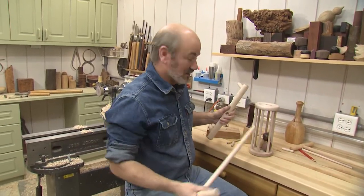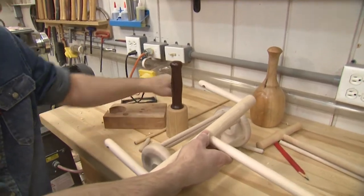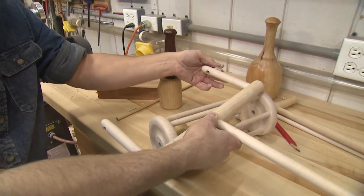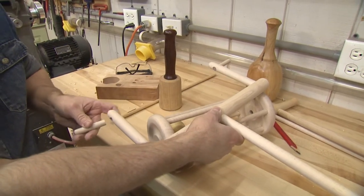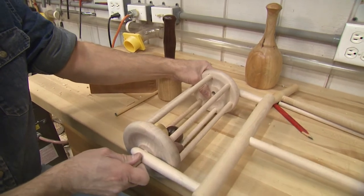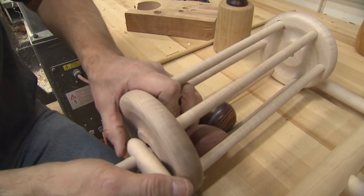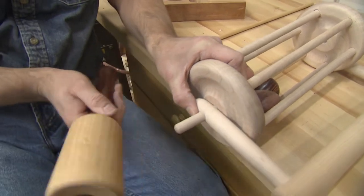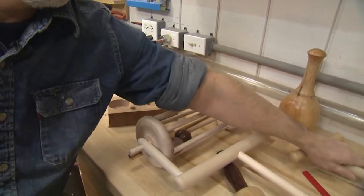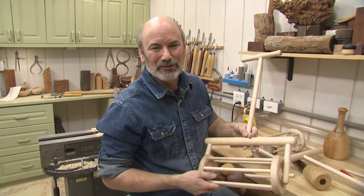I saved you the pain of watching me get that done. The rest of the assembly is pretty easy except for the axle part. When you put the axle holders on there, run a dowel rod through it as you line it up because you don't want them crooked — if they're crooked, you're in a lot of trouble. We take our pins and run them through here, because remember we had that almost perfect jam fit. We come into here, hold the axle on, and get that to feed into the wheel. We tap it through until it comes out flush on this side for a nice fit. And once we get that done, we wind up with this beautiful project. A lot of steps, a little bit complicated, but it really turned out well.